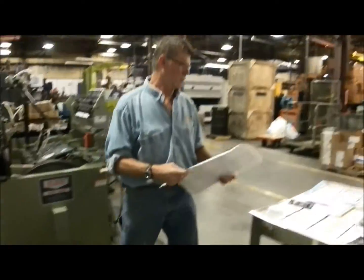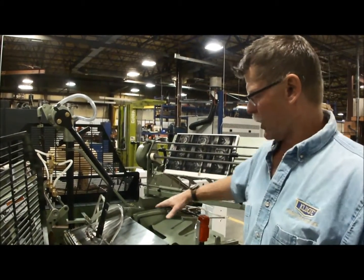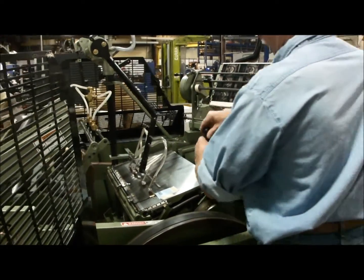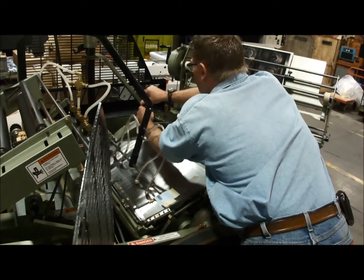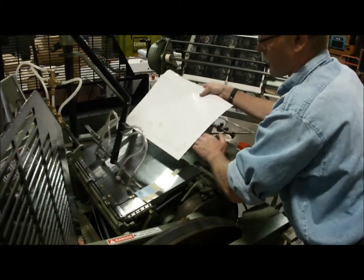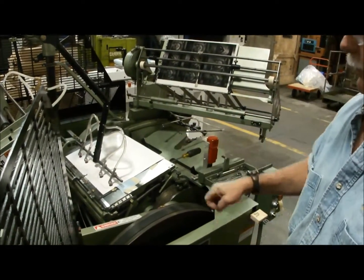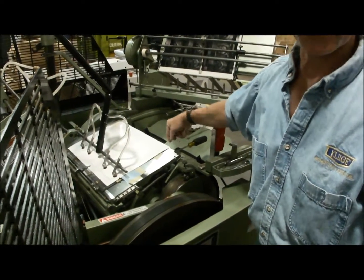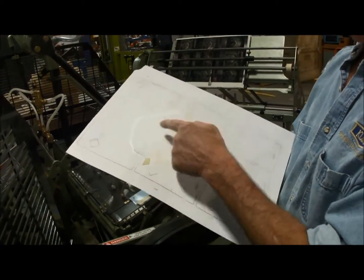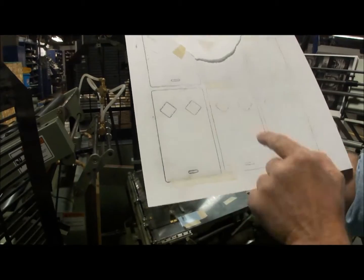As far as the make ready goes, we've got a few minutes — it's going to turn into a little bit of a make ready class too. What I did is put a spot sheet, the same material as I was die cutting, on top, and I laid carbon paper on top — good old fashioned carbon paper. I taped the spot sheet down, put carbon paper over it, put another sheet of paper over the top, marked the edge of the paper so when I go underneath the plate I know where my cutting rule is. I had a little low spot, so I did just a little spot make ready.